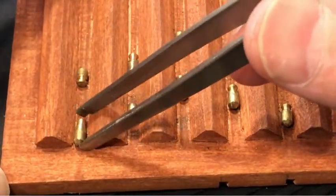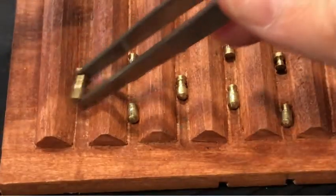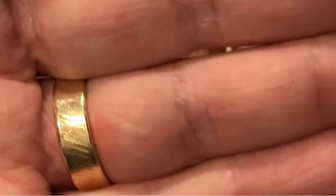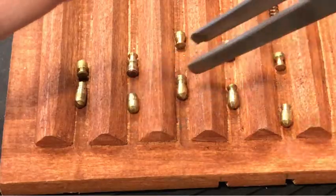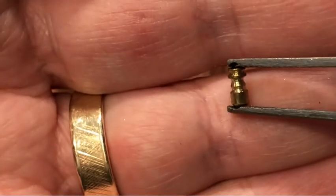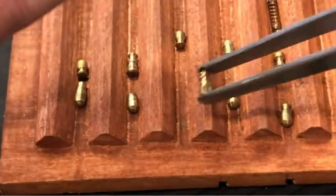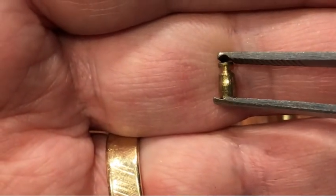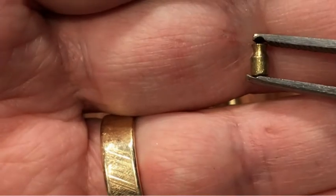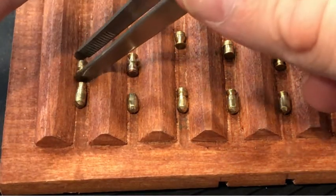Okay, crafty number 1 key pin. Number 2 has sort of a couple narrowings. Now look at that one. It belongs on a railing, holding up a railing. That's number 4, and it has a neat little spool on the top. And finally, number 5, just narrowed at the top, not quite spooled, but it probably would behave like one.